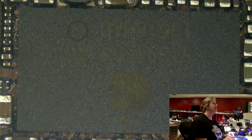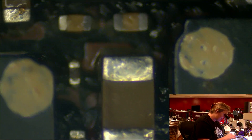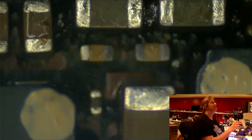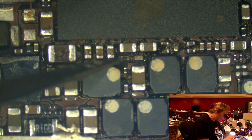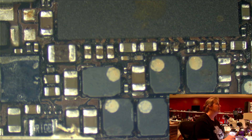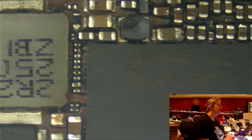But if we look for more signs around the board, here's something that really concerns me. Looking at these two capacitors here — this is clearly water damage. There's really no other explanation: this iPad Mini saw water on this board at some point. It was a water-damaged board. And that is huge. If I saw water damage on a board, I would not sell it to someone as a refurbished board. And Apple obviously did. So this board originally had water damage, and maybe some components were replaced, but they just didn't bother to replace the two littlest caps because they would likely have a pretty minor function. And then they drilled out and replaced the power management chip.